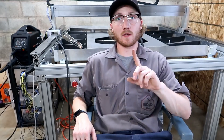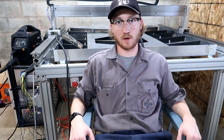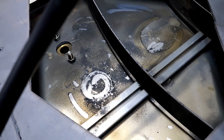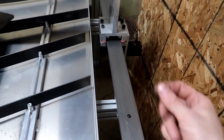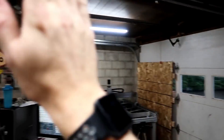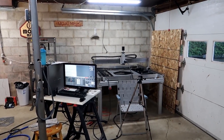It's definitely been an adventure. I should probably put some type of water in this table — I know there's cutting fluid you can put in there, but I'd like to just put water in here because it's free. I'm sure the water will cut down on all the soot and stuff. Look at all that stuff floating around down in here — it stinks. I'd prefer not to have this stuff floating around because I have CNC machines nearby with rails. I'm going to have to wipe this thing down regularly. I might close off this area — maybe some weld curtains or cracking that door might help.